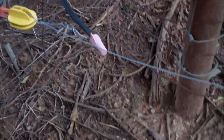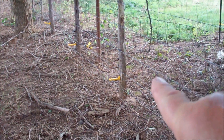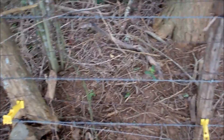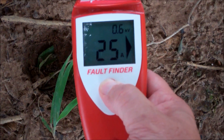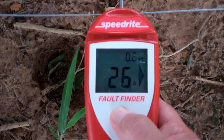So I just have to trace it out — let's look for it. Here we are on the outside of the fence, where I was showing you earlier on my property. I'm on my neighbor's property right now, checking the fence. The fault should be going this way. I test it, and the reader tells me there are a lot of amps going somewhere — going out somewhere where they should stay in the fence. Still heading that direction.